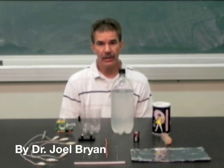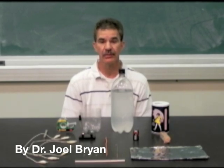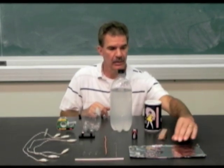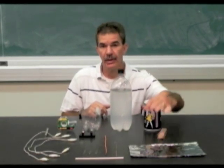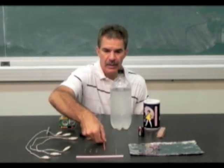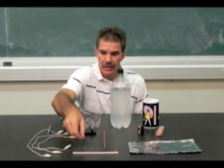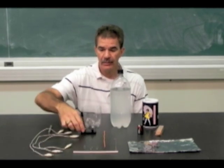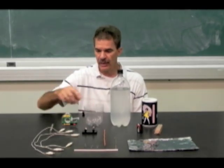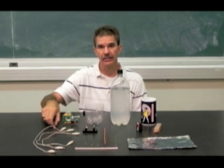You can build a working replica of Michael Faraday's original DC motor using just a few simple, inexpensive materials. We'll be using salt water, a small piece of modeling clay, a small piece of aluminum foil, a 9-volt transistor battery, two pieces of stiff copper wire, plastic straw, three small paper clips, three alligator clip connecting wires, a knife switch, a 2-liter plastic bottle cut as a bowl, some transparent tape, and a stack of small neodymium magnets.